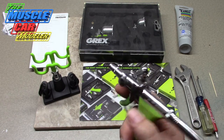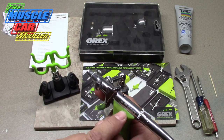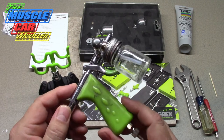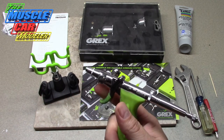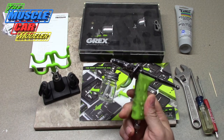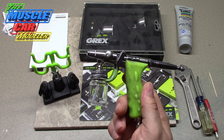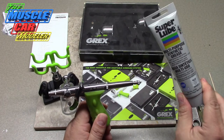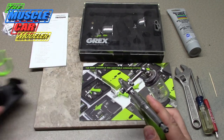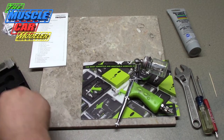For a while I was thinking I just wasn't cleaning it very well, but after tearing it apart I saw what was going on — cleaned it up, lubed it, and it's working smoother. I'll have to admit I wasn't lubing it properly. Even though I've had many airbrushes, I don't recall having to actually lube the Badger 150s — this one requires some lube. I'm going to tear this apart, do a full teardown, and show you what's going on and the parts I bought to fix it.